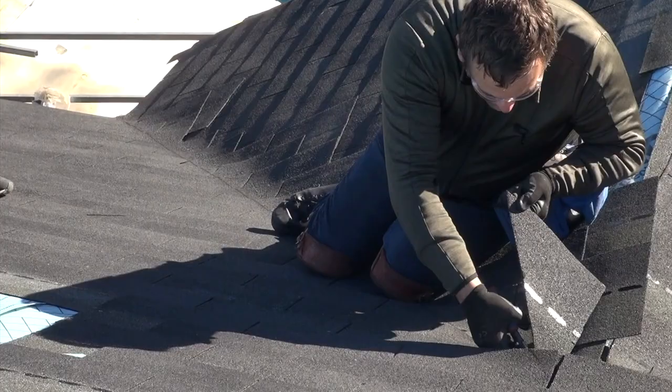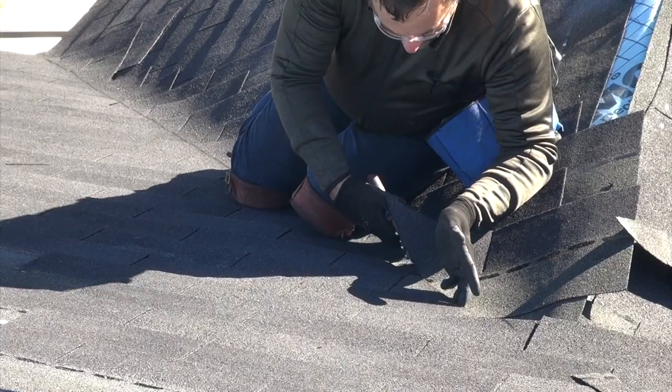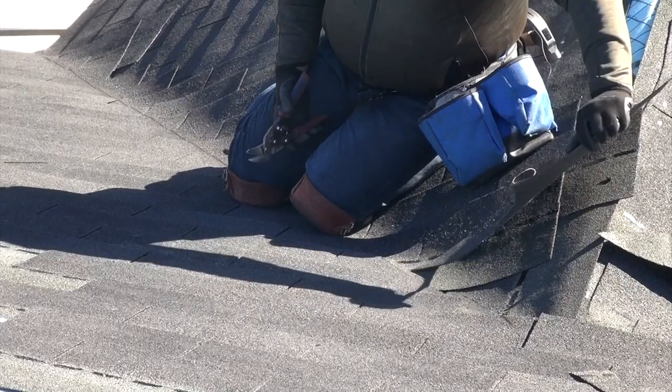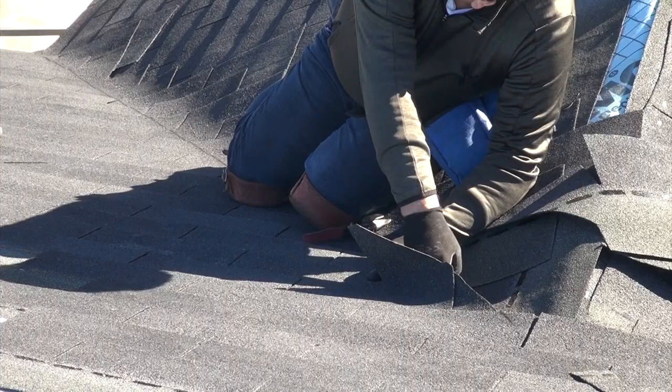So this is the face here, and once we're past that, you don't need to be so precise with the line — I sometimes actually just go in a little bit from that. But then when we get up a little bit, we'll make this kind of cut so we don't have a sharp corner. Because if the sharp corner comes in on that corner and we cut the corner off, the water's going to come down here and it could catch that corner and kick across the top.